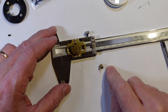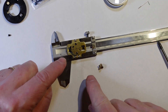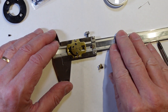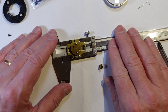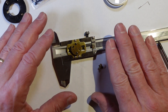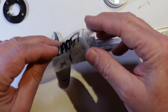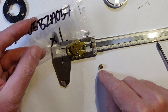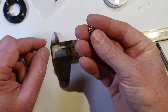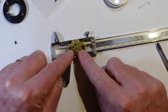As you saw from the comparator, one of the gears was absolutely chewed up in just a small spot, but that was what was causing the problem. I went and got a price for the whole assembly - it came back at something like three-quarters of the replacement cost of the caliper, which was no good to me. I have a rule of thumb that says spend about half the replacement cost in repairs. Then I thought maybe I'm asking for the wrong part, so I looked at my parts list and pulled out the number for just that little pinion - and that came in at around one-eighth of the replacement cost, well within my rule.